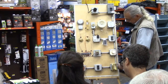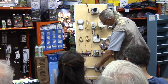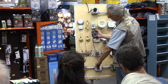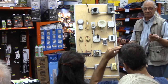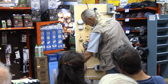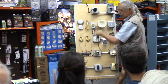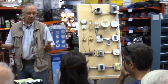So why don't we test our outlet? 119.56 — so we know the voltage is proper. Same thing here — same readings because I'm getting the same voltage source. I've just tested my outlets with a meter. That's how you do it.